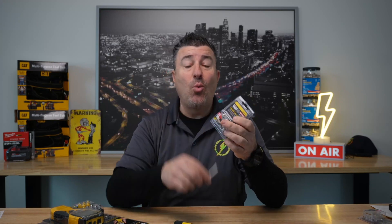The cool part about the pass-throughs is once you get that wire and stick it through the pass-through, it hangs out the other side. You can then check and make sure you got your color coding right, and then you clip it and you're good to go. It's the easiest method to get all your Cat 5 and Cat 6 data plugs in place.